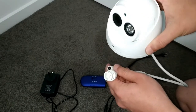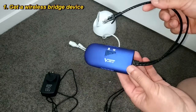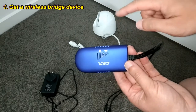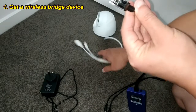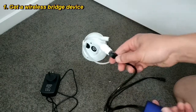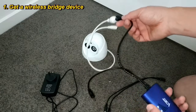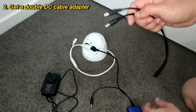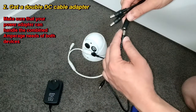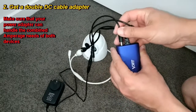So how would you turn this wired IP camera into a wireless camera? You would buy such a device — this is one example of a wireless bridge. What a wireless bridge does is this device connects to your Wi-Fi, so it acts like the antenna and connects to your wireless router, and it provides a connection to your network through the LAN port here, so you plug that into that. This is as if this wired camera is plugged into your wired network through a LAN cable, and you just need a double power DC adapter — this part here would get the power from your power supply.